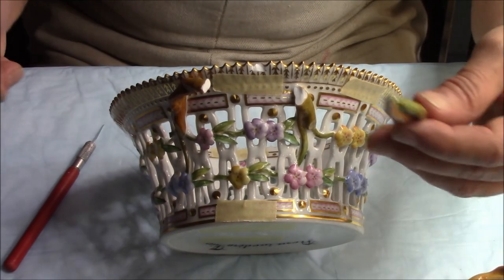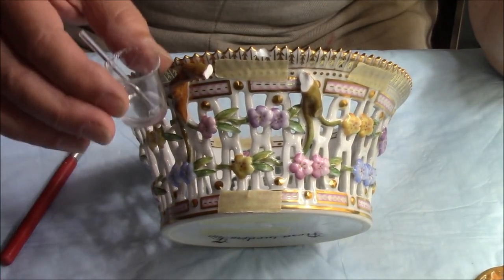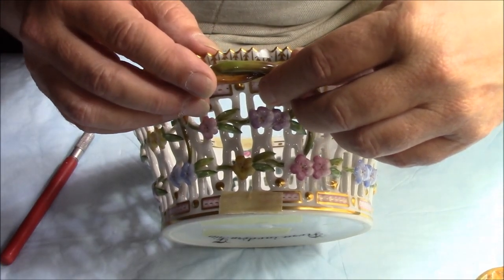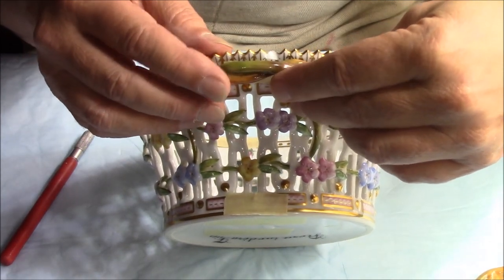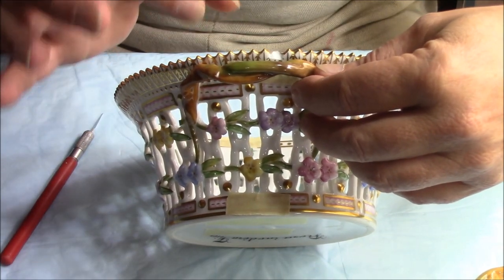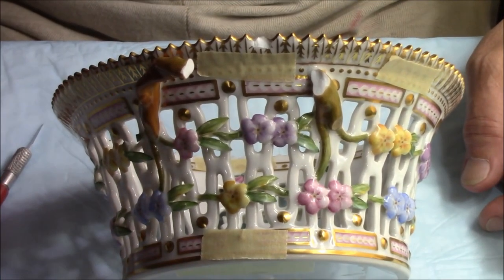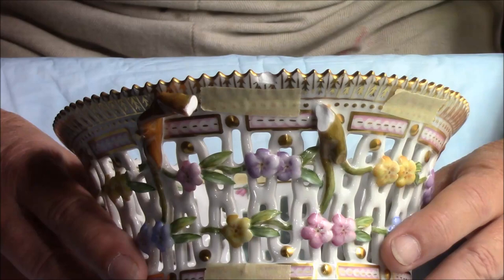The other thing is, if I wait a couple days, this will get thicker, the Hxtal will get thicker, and then I can actually put this in place when I'm done working on that area. I can get this in place and hardly use any tape at all to hold that in place. The stickiness of the partially cured Hxtal will make that possible.